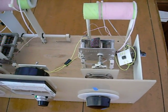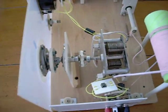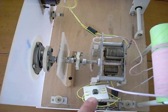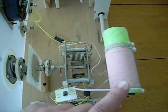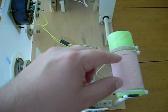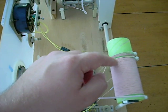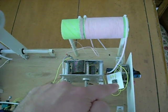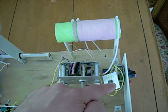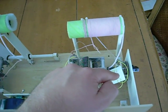This is not your grandfather's crystal radio — it uses some components from back in the day but has some new modern twists. In fact, this actually uses the Advanced Linear Devices Zero Bias FET as the detector. Here's my detector tank coil — the main tank coil section — and then I have a small takeoff coil right here, which is only about 10 to 15 percent of the turns ratio of the main tank. That allows us to take the voltage seen at the top of the tank and feed it into the gate of the FET, allowing the FET to switch on and off depending on the audio, converting RF into intelligible audio.